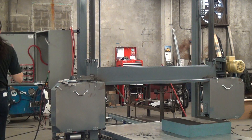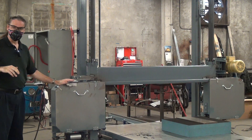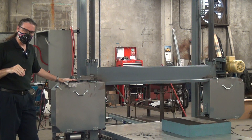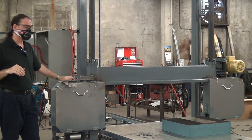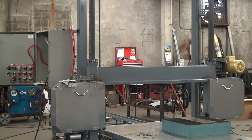I've already set a table advance speed that I know works. The blade speed on this machine is fixed — we're running about 3,000 feet per minute, with a blade tension of about 18,000 PSI, which is 60 PSI on the pressure gauge. This machine has pneumatic tensioning. Now I will stop talking and start cutting.